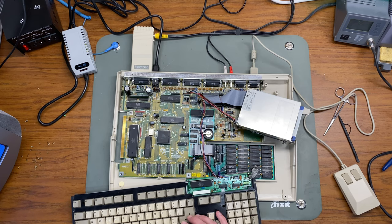The return key still does not work. What's more, the place I ordered it from said that the US and the UK keyboard membranes were the same, but they're not — the UK membrane actually switches all the keyboard keys to the UK layout. So none of the keys are where they're supposed to be for my US keyboard. So I'm just going to switch back to the original membrane, because at least it's in the US layout.